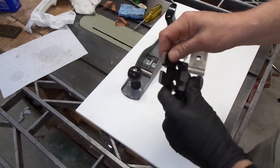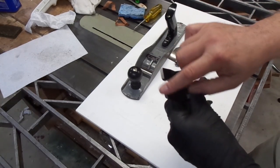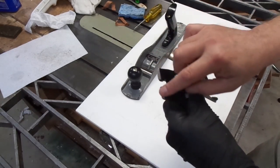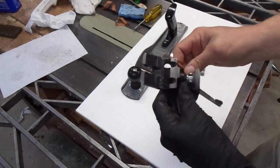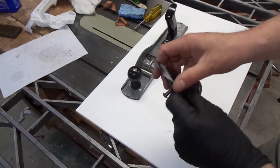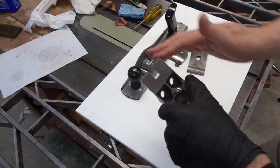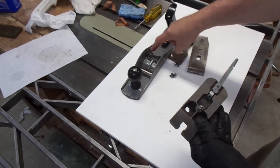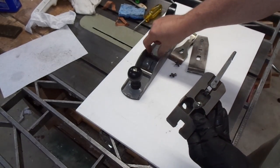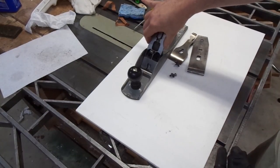You can still see some of the scratches on it despite my sanding technique. I think the paint had been removed with something like a woodworker's rasp. I had to flatten this entire face. The frog itself wasn't square, so I had to spend some time to square it up. And then I had to spend time to get it to sit against the seat on the plane so that it didn't rock.